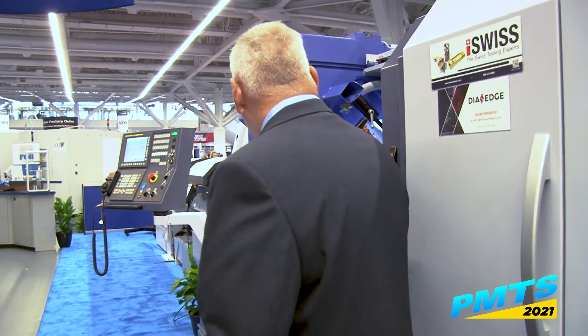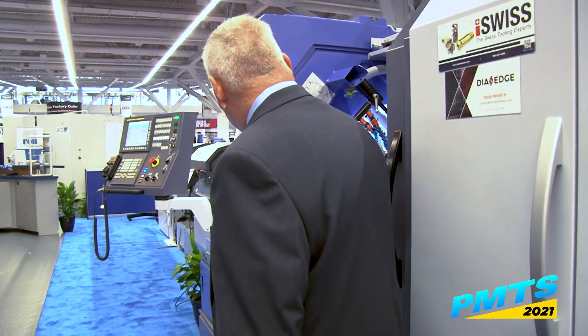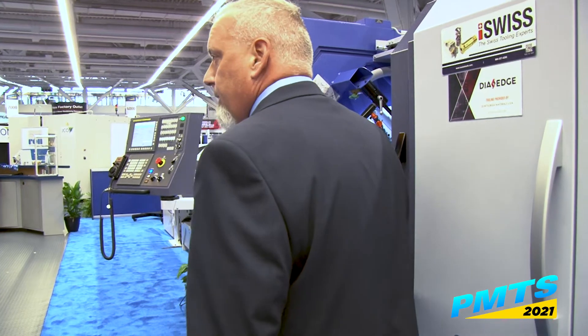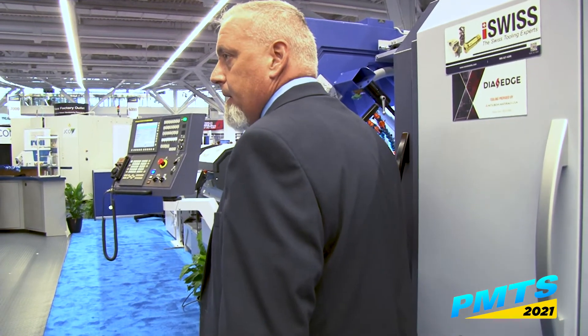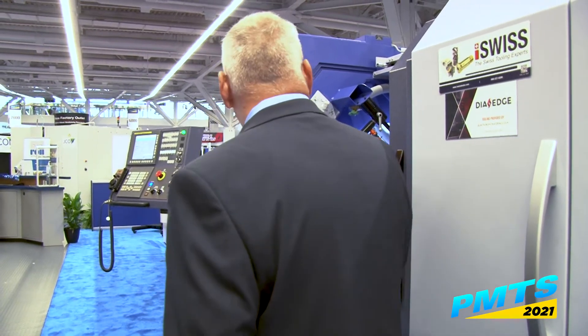There are a lot of ID tools. We can get up to two spindles of cross milling, two spindles of face milling, counter face if needed — there are a lot of opportunities in the turret. This turret not only moves up and down and adjusts to center, but it also moves in the Z3 axis to be able to work on the subspindle at the same time. The bottom turret is a huge asset inside this machine.